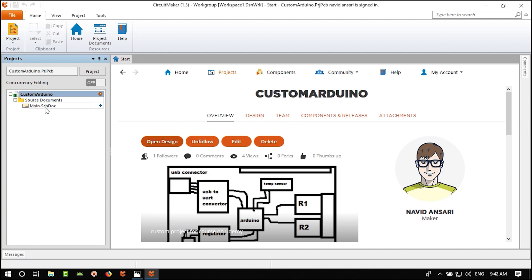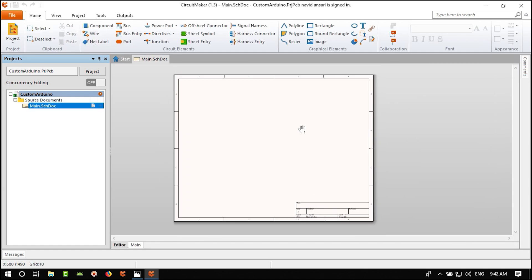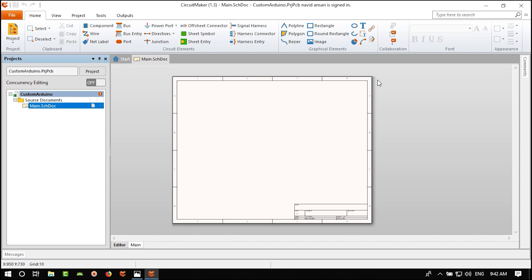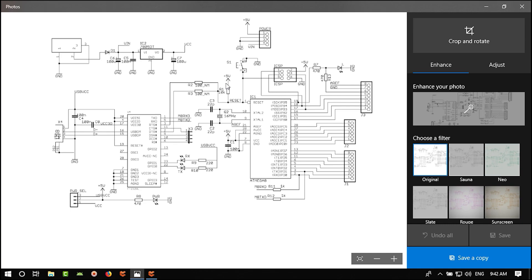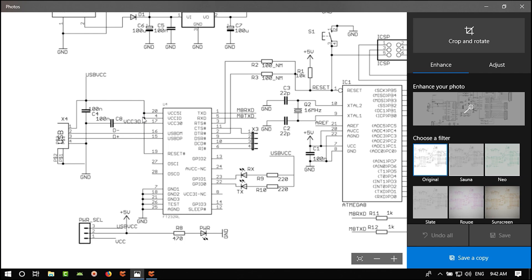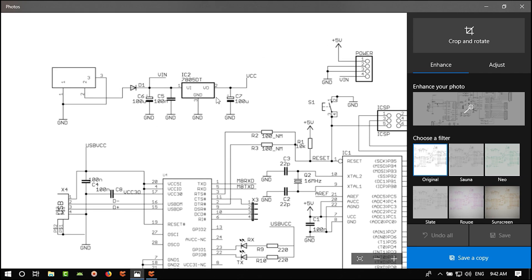You can see the schematic sheet. Let's begin with the regulator. In Arduino the regulator is the LM7805, but we can use another part like the LM1117. You can search and download its datasheet — I think that one is cheaper. The good thing about Altium is you can check component prices directly in the software.